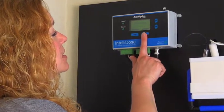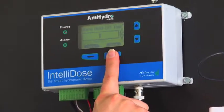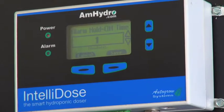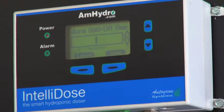So you go to your alarms and hit enter. Now we have a hold-off time of one minute. One minute is a little bit small, so I'm going to increase this. What the hold-off time means is that if something reads outside of your set points, it'll wait one minute, and if after one minute it's still reading outside of your set points, then it sets off an alarm.